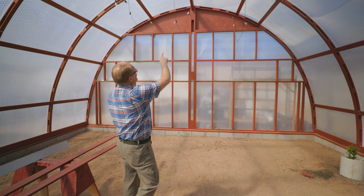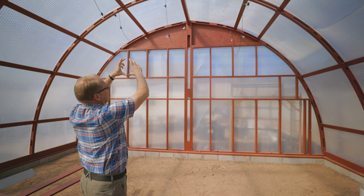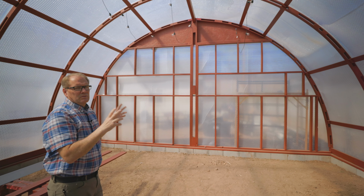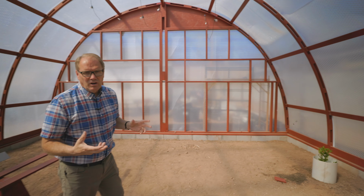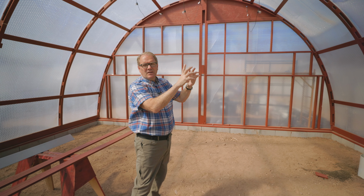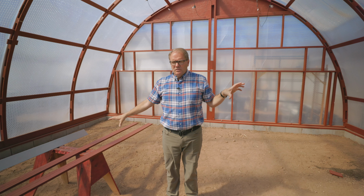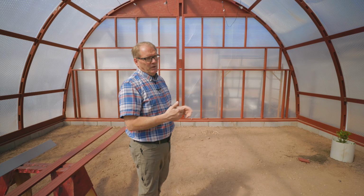And so you see that this here is one truss that we built, and it lands right on the beam. This is another truss that's built, and it lands right on the beam. And I wanted that kind of rigidity, so we actually manufactured one of these at a time inside the garage. I'm sure a lot of people are going to think, how did you build the whole thing? Well, it's actually a quarter circle, if that makes sense. A quarter circle there and a quarter circle there. And if you can imagine another quarter circle on the ground, another quarter circle on the ground there, that's basically what we built. But of course, we didn't build the underground part because we have a foundation.